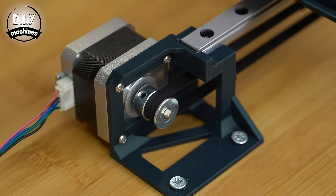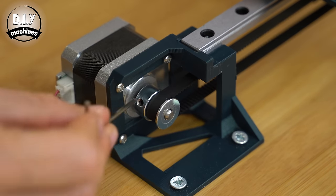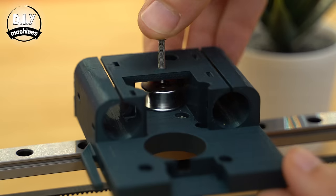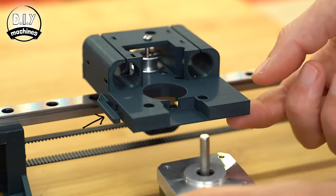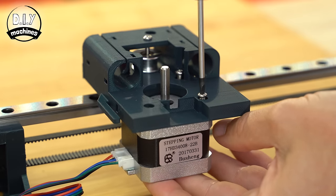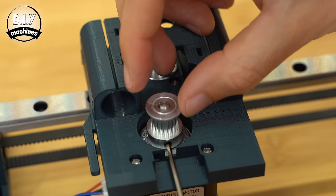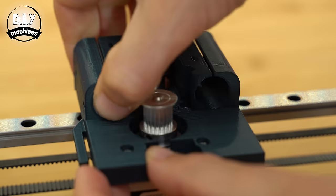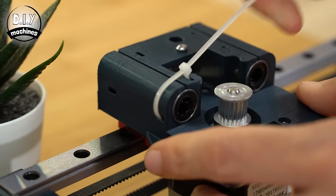You can now slide the powered pulley along the shaft of the stepper motor so that it aligns comfortably with the belt's position. Firmly tighten the grub screws, ensuring that one of them tightens against the flat face of the shaft. Start by securing the idler by placing it in line between these two holes and securing it in place by feeding the M3x18 bolt through it. The second motor is presented from underneath the raft with its wire facing out towards the small arm — secure it in place using three M3x10 bolts. Now add the timing pulley on top and secure it to the shaft so that it sits flush with the tip. Slide the two long linear bearings into the housing; it may need a firm push to fit, or if too loose, use four zip ties through these holes to hold it secure.